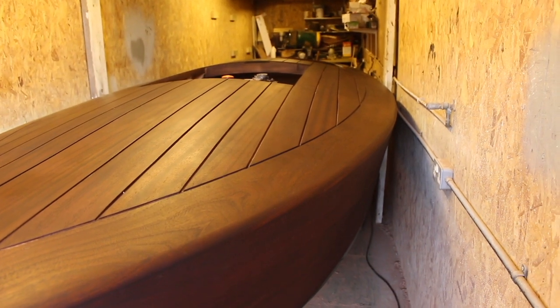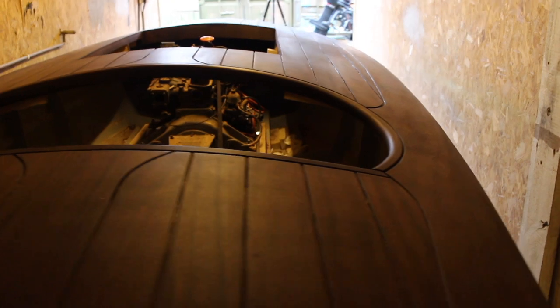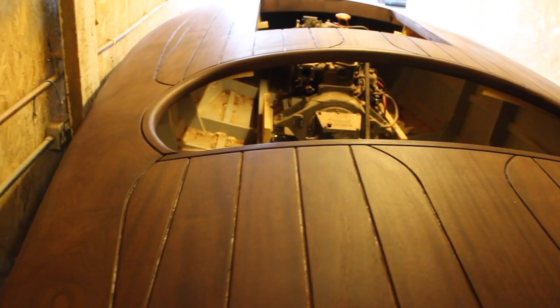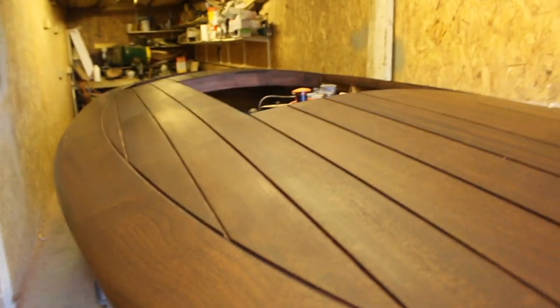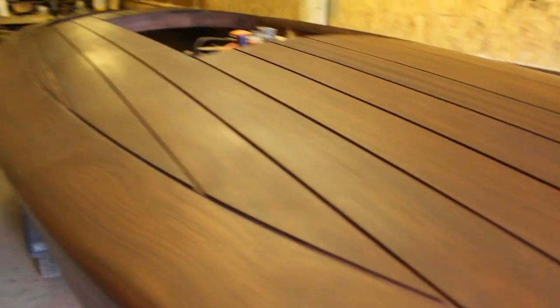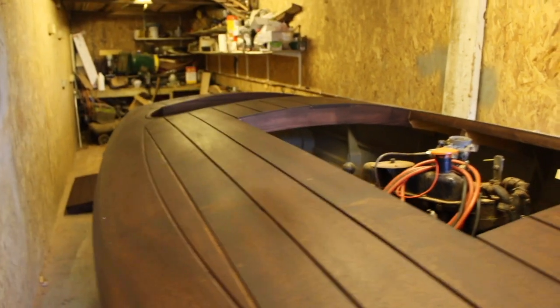It's got a much more reddish-purple colour to it, which you should see appear — it looks a bit like a bat boat at the moment. It's got a nice even colour all throughout the wood, which gives you a nice uniform finish. The thing I like about these stains is that you still really keep the grain pattern — there's no streakiness on top of the finish afterwards. I'm just going to leave that for a day and then put some varnish on tomorrow. We could probably varnish straight away now because this has all flashed off, but it's getting a bit late in the day.